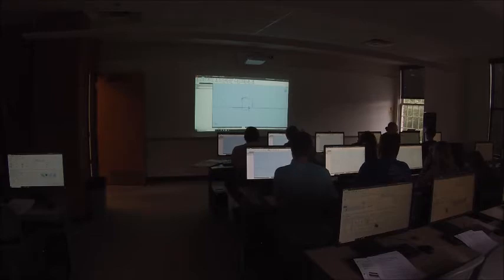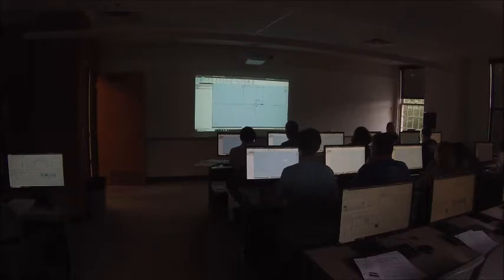So, all right. Next, we know that we want a little extension on the edge of this bracket. The bracket kind of looks like a triangle like I drew on the screen. But then we want a little extension to mount to the tube. So we're going to draw the top of that extension with just a horizontal line up here. Okay, and I'm still creating lines, and so now I'm going to create a vertical line. This is going to represent the end of the tube, right? The end of this bracket will line up flush with the end of the tube, basically. So I'm going to create a vertical line there like that.